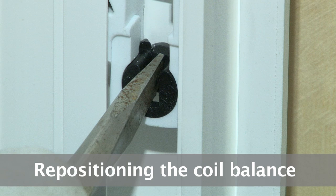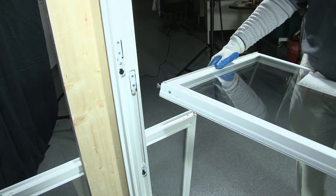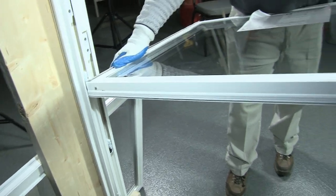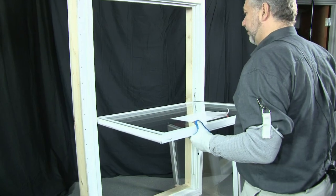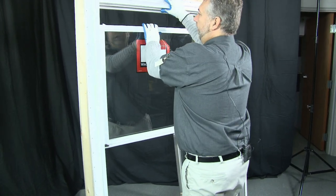This applies the brake and will hold it into position. To reinstall the top sash, you would first place the pivot bar back into the balance shoe and slide it down on this side. You need to line it up with the other side. Once the sash is level, you tilt it back into the mainframe, making sure your tilt latches lock into place.